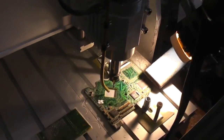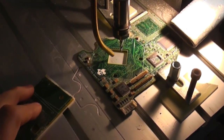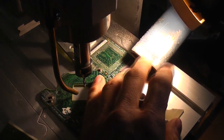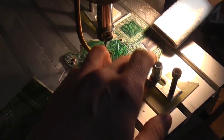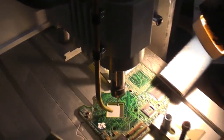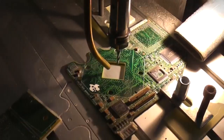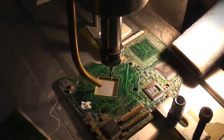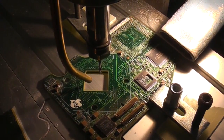I decided to set this up on my little TNT engraver. This is the basic setup - we've got the potential victim down here. We need dust extraction to keep all the dust out of the way, so we've got a vacuum cleaner inlet here. But as well as that, because you're creating a cavity you tend to get dust accumulating in the cavity. So I've also got this line here which is actually an air pump - a diaphragm pump, so instead of a continuous stream it gives you bursts, which is quite good at dislodging dust out of the hole and keeps it quite nicely clear.